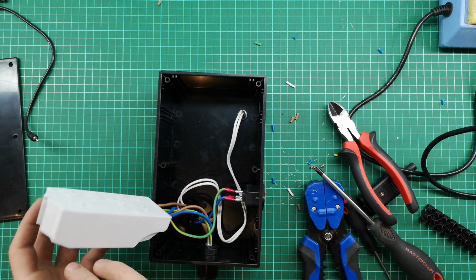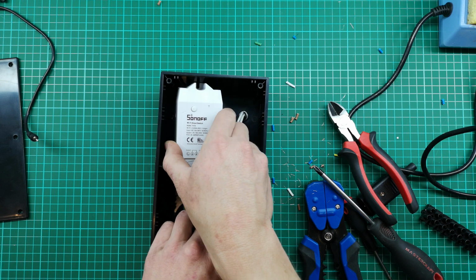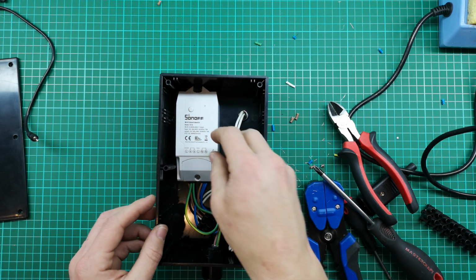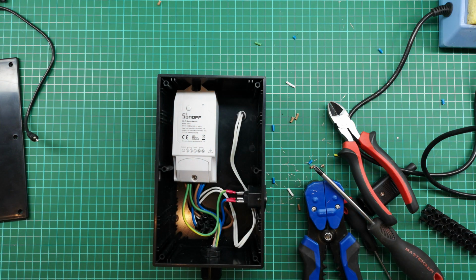I've used cable glue on a couple of things before that are not necessarily cables, but it's pretty good with these plastic bits. The trick though is it's kind of like contact. You want to pressure down, and then you just want to release it for a couple of minutes so that you can allow that glue to get sticky, and then you push it down again and then it sticks for good.